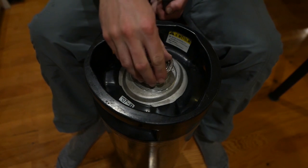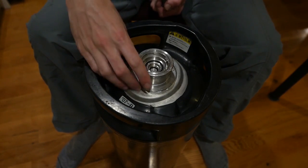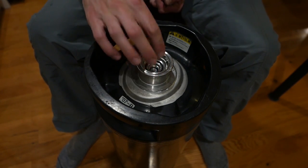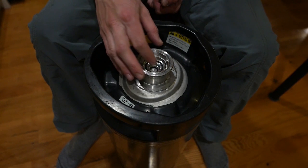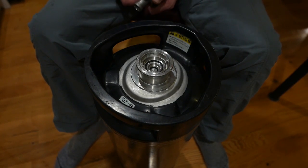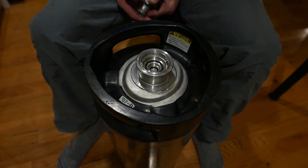Once that's removed it's not going to come all the way out. There is a locking safety catch that's part of this mechanism. The point of this is that if this were unscrewed while the vessel is under pressure, it's not going to take someone's eye out when it's unscrewed.